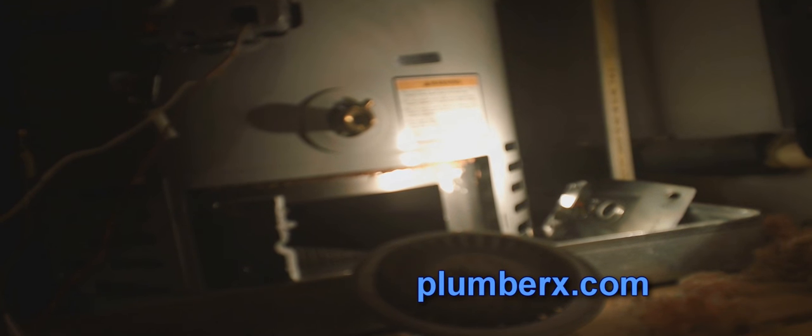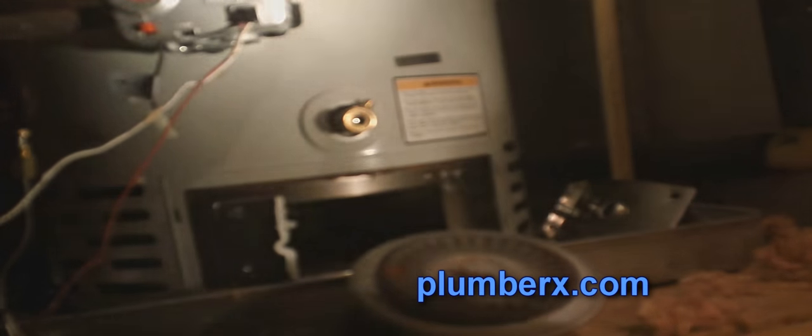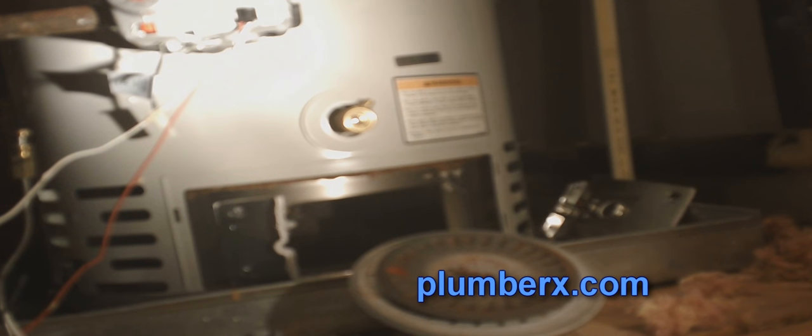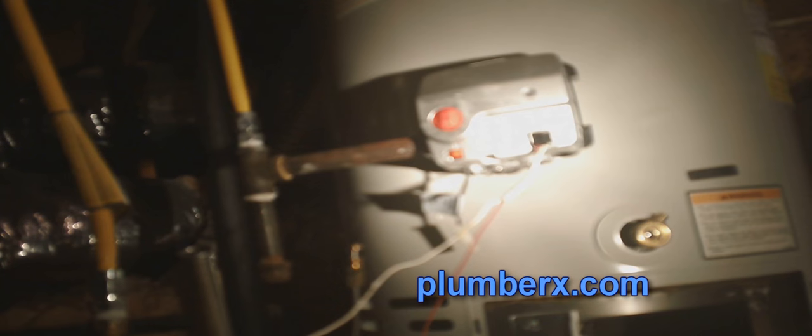What I actually do is cut the water to the water heater off, and then flip the relief tube up at top to relieve some pressure from the water heater itself, so that when I do remove the control valve on the side here, the water doesn't come rushing out. It'll just kind of blurp out a little bit because there's no air in the tank to allow it to just flow freely out as fast as it could. And this is something I do, and I do it pretty quick. So you'll see me do this.